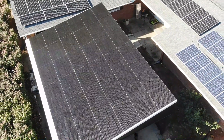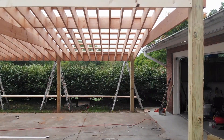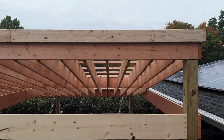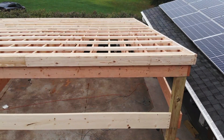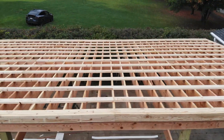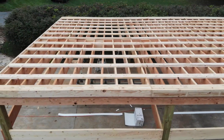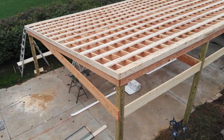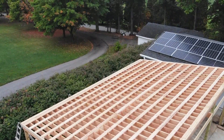The materials we used to construct this: the front four 6x6s are 12-footers and the rear were 16-footers. I bought about 44 or 45 2x12x24s and they got cut down a little bit because I needed a 22-foot span at the very least, but wanted it to go over the drive and not beyond. On top, for the purlins, I used 2x6x8s — I know that's a little overkill, but the way I fastened the panels down it made it real easy. It would be hard to miss connecting them onto the two by sixes.